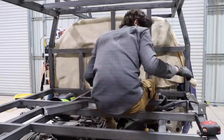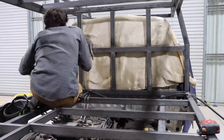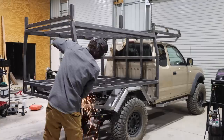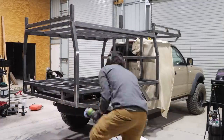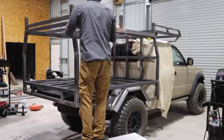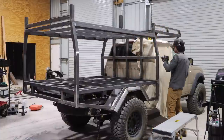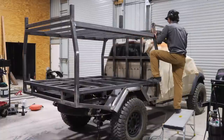Most of the framing members are eighth inch and then everything else is 16 gauge, obviously just for weight — most things don't need a heavy gauge thickness of steel. But I wish these upper framing portions, or these load-bearing portions, I wish I had done them in a slightly smaller gauge of steel just to cut down on the weight of the truck.